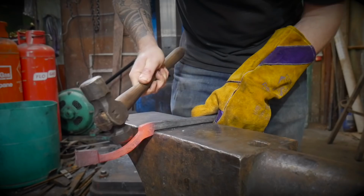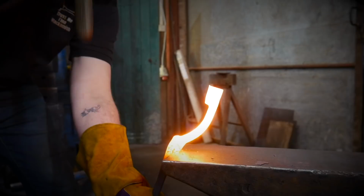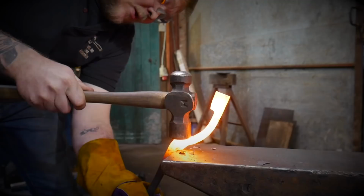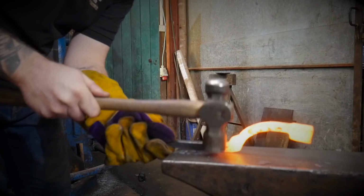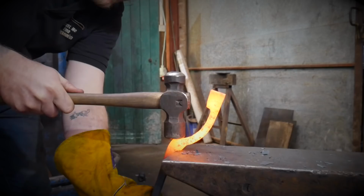And then you want to get a really nice heat on your hinge plate area. I'm going to hold this on the heel of my anvil. You can do this on the side of your anvil. I'm doing it here just to show you what I'm trying to do. And I'm going to flatten that down until the hammer face comes in contact with the edge of the nib, or the start of this bow part. That starts to change the shape of the hinge plate. I'm going to flatten that down. I'm just going to knock that forward a little bit. And then I'm just going to round this back end up,